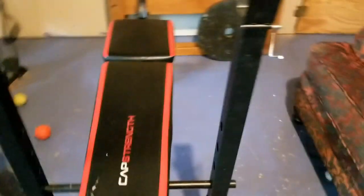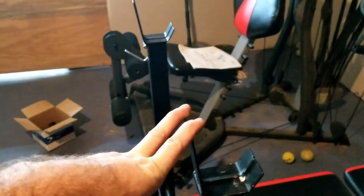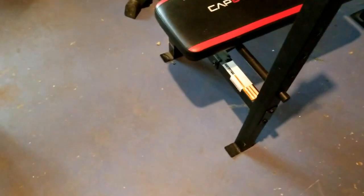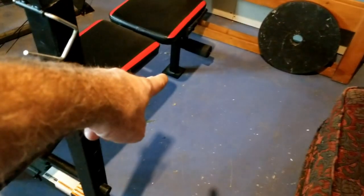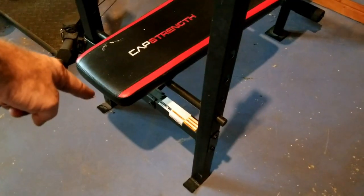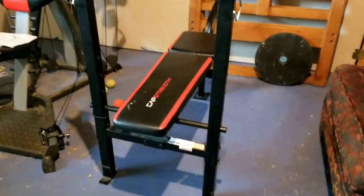I've got one more thing for the weight sets I've got to do. This table, or this bench press here, if I put 135 pounds on the bar, which is light, it tries to fall backwards. So I'm gonna extend those feet about a foot with some angle iron just to prevent it, and I'll extend them out this way a foot, and then I'm gonna anchor them to the front foot. So it'll just kind of be angled out like this, and then it'll turn, come straight out this way, go that, turn that way, go straight to there, and then angle back to that, just to make sure that it's solid and that it won't flip up on me.